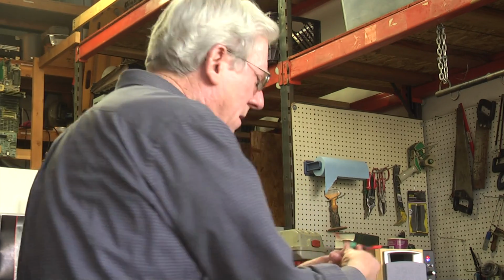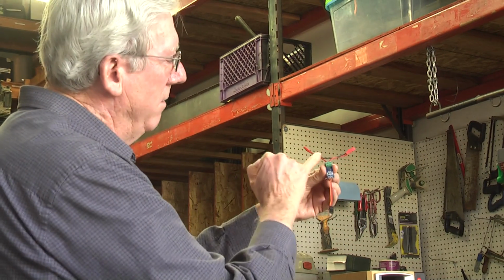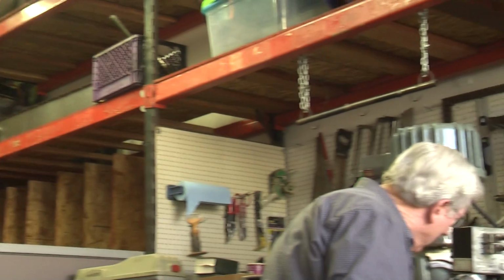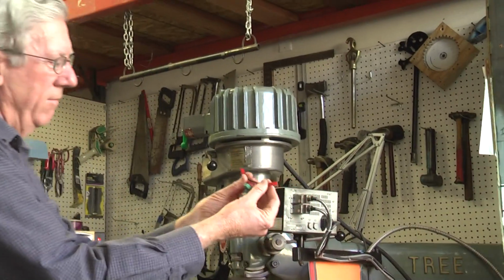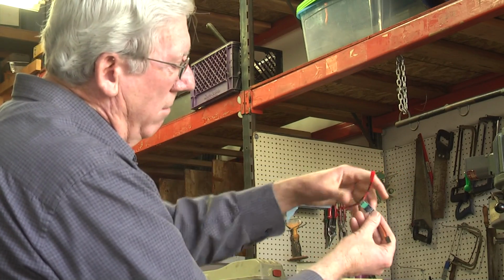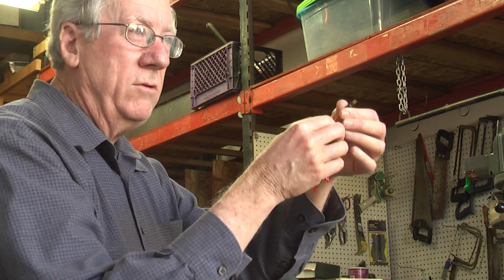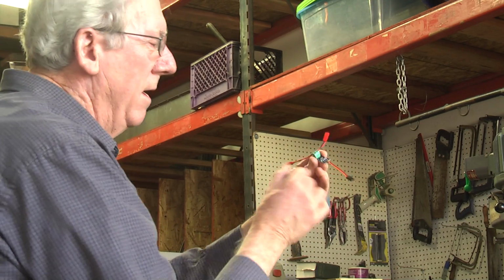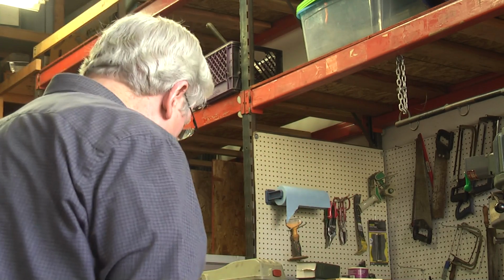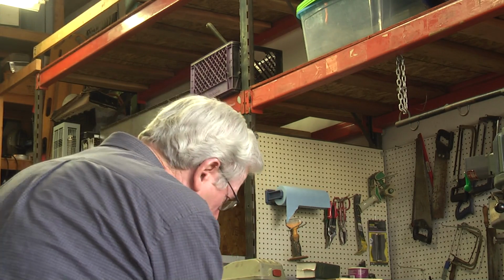Here is a sensor that you can buy from SparkFun, where you can put it between the battery and the controller for the motor of your model airplane or anything. They sell you just this part, and then you solder on a connector on each end. In this case, I've adopted the servo wire that's associated with model airplanes, and all I had to do was rearrange one wire, and it plugs into the sending unit, the XBee.